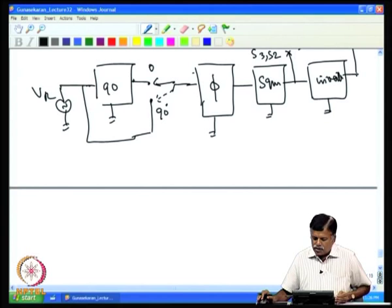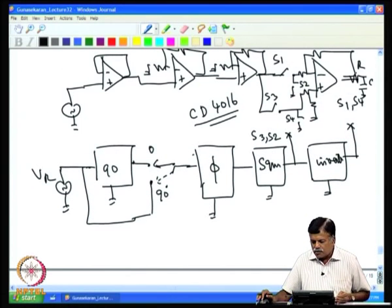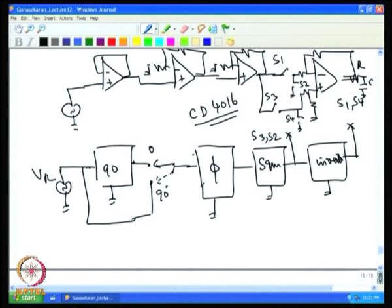Now, in this lock-in amplifier, of course, you are getting an output voltage which is not sensitive to noise, in the sense that a signal which is buried in the noise can be extracted. Of course, the output voltage is only DC. The original signal is not retained as it is. We were able to separate out the in phase and out of phase components, and we are able to remove the noise, but the original sine wave is lost; we do not get the original sine wave.